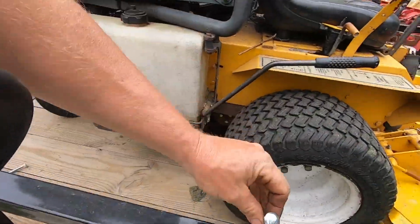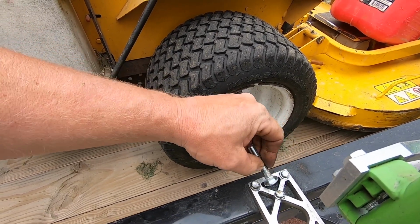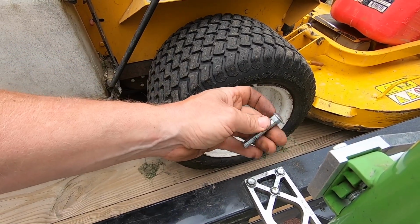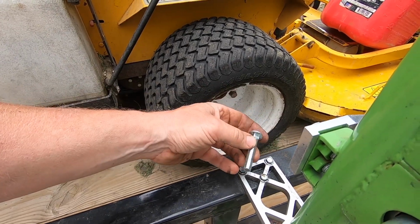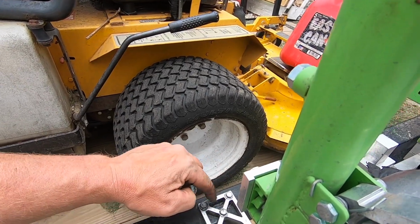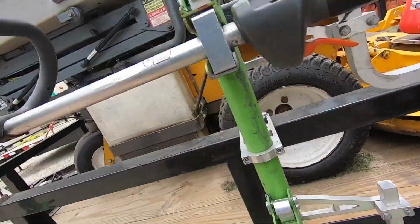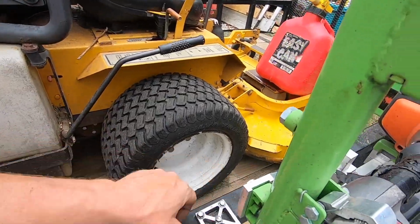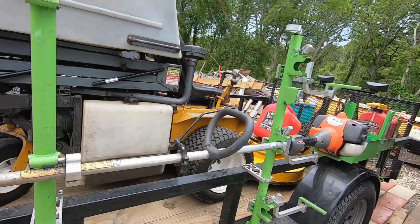Wonder if the head, yeah, see, that head will overlap this just fine, although then I won't be able to hold it because it doesn't have the square. Okay, so I'll probably just get a 3/8 bolt, same as those, the 3-inch, but with a head on it, not the carriage bolts, and then a washer. Drill a hole, put the 3/8 bolt in, and then a lock nut on the bottom there, and the same thing here. And then I'll tighten these up just to help support it and stop it from wiggling side to side. And I think that'll be fine.